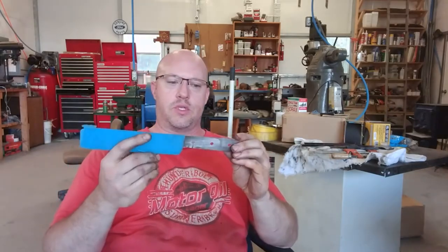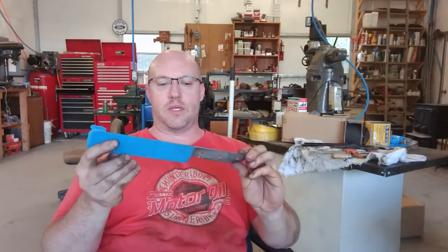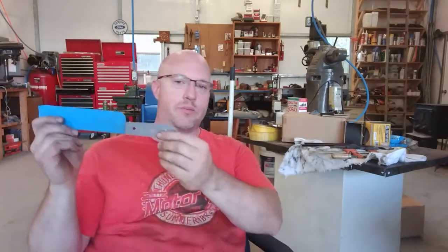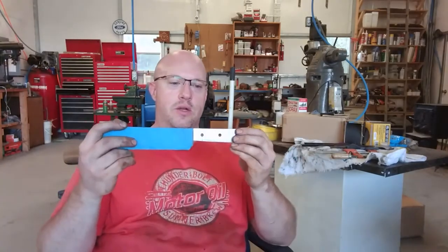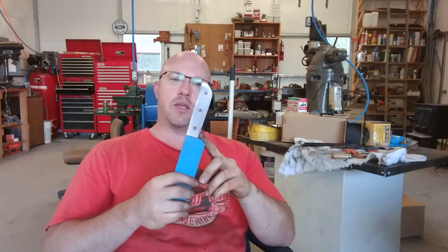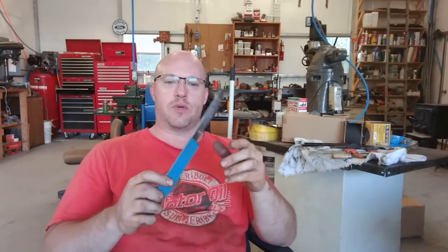I worked it hardened — just cut out the saw blade and did not anneal it. I would take a pass on the grinder straight into the water, pass on the grinder straight into the water. Took a lot longer. Those holes were interesting to drill — good thing I had a quarter-inch carbide end mill, otherwise no go again.